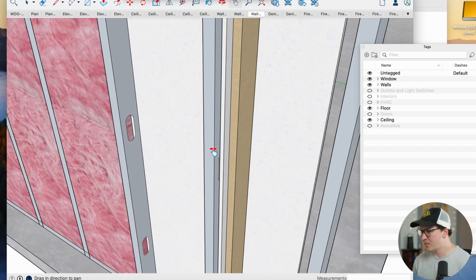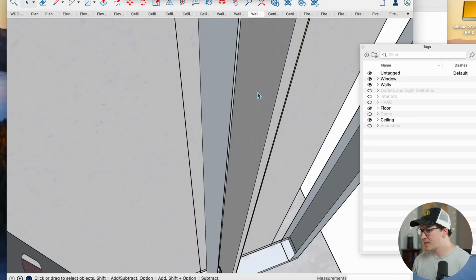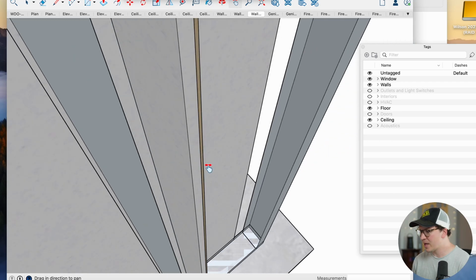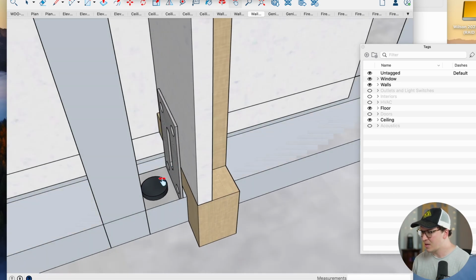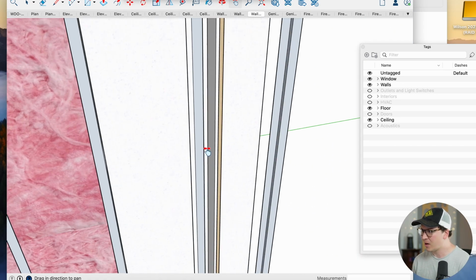And you might say, oh my God, Wilson, doesn't that mean they're connected? It actually doesn't, because what's happening here is you've got the rock wool that's connected here, and then our drywall actually does not fully connect, as you can see right here. So this is kind of a clever way to create the fire stop, and then you've also got the LB bracket, which is an isolation bracket that's connecting them at the bottom, and then the drywall doesn't touch our metal studs. We just stuff this rock wool around there and seal it up with fire acoustic sealant or fire caulking,